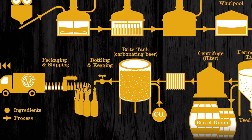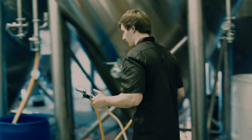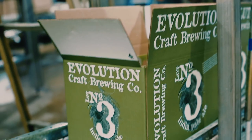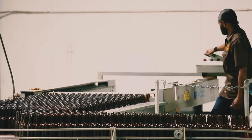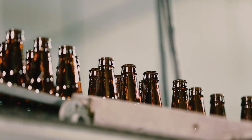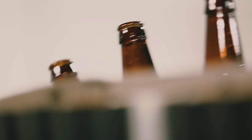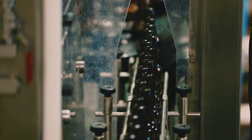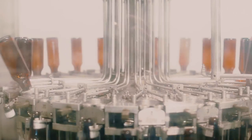At this point we've got two options for packaging. First we can do draft — if it's a draft product we hook up some lines from the bottom of the tank and run them directly to clean and sanitized kegs, filling those kegs directly through the top tap. If it's going into a 12 ounce bottle, the best way to follow this is to actually follow the bottles. You'll see they first come into a machine called a depalletizer — it's doing just that, depalletizing. Every skid of glass you're looking at has 2,250 brown bottles. We prefer to use glass; we think it's a little sexier, we like the way it looks, and we appreciate that it doesn't contribute any additional flavor characteristics to the end product. A very important part of the actual packaging is a three-head filler — first, every bottle is going to get flipped upside down, sprayed with sanitizing solution, and allowed to gravity dry.